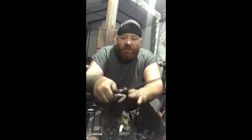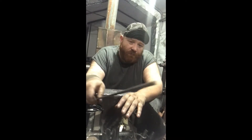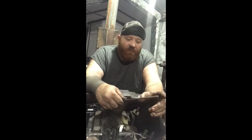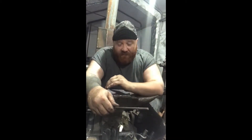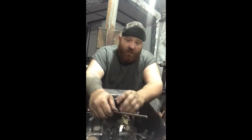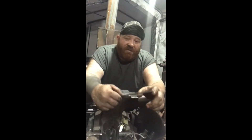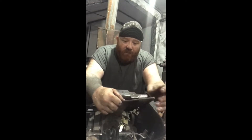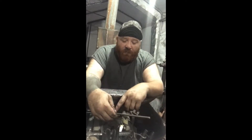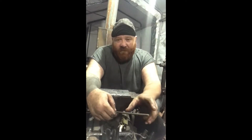Bracelet. It's going to be made out of quarter inch round stock. What we're going to do is end up about seven and a half inches straight, and then bend it around. But I'm going to upset this end first, and then make a ball on it, and then I'll measure how much I have here to start with.